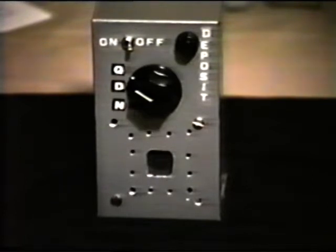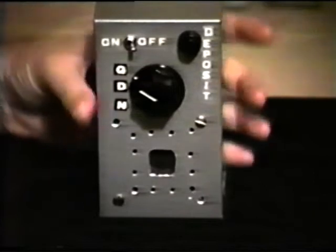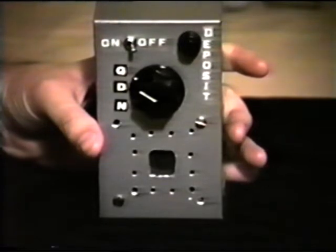Some older phone systems use only the 1700 hertz tone, but the dual tones of 1700 and 2200 hertz tones are fairly standard throughout the United States. This particular red box is unique in that it does produce all three coin tones. It does not just produce the quarter tones.